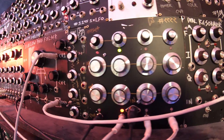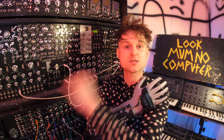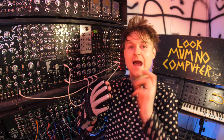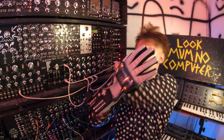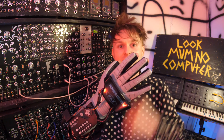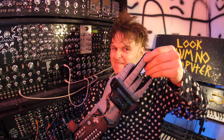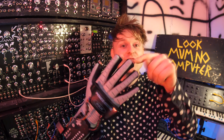I've now got the interface plugged into the modular synthesizer, which is plugged into the Power Glove. I've got it wired into a very simple patch to start with to show you how un-musical it really can be. I'm really quite surprised at how natural it feels to control it. However, it's very hard to play in tune. Right now this finger is the volume, wired into a VCA. The thumb is the filter cutoff - so that's how bright the sound is. This one's the pulse width. It's very hard to use each of them separately. And then this one finally is the pitch.